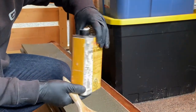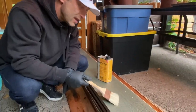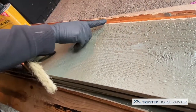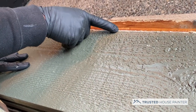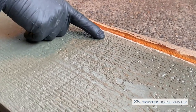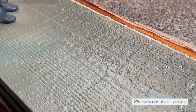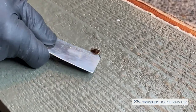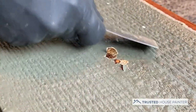We're doing this demo because we've removed some siding that was painted over a stain. If you look carefully, you can see the original wood, then a little line of white — probably a primer or solid stain from a previous coating — and then you see green. The green identifies paint. I know that because it's shiny and it's got these bubbles all over it, and by simply popping a bubble you can see I'm lifting up the paint — it's happening everywhere through here.